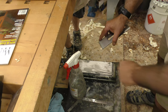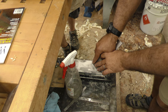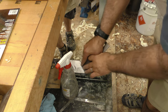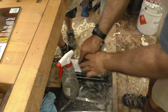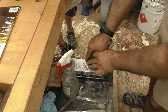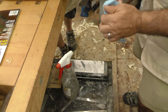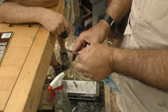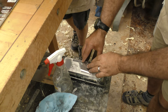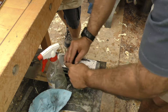Now we'll go to the 16,000 grit. Feel that bevel, come up a little more than on the 1,000 grit, move back and forth — it's a soft stone — even pressure for about 10 seconds. I'll finish with about three seconds of pressure on the right side and three on the left side. I should see a mirror finish — I'm seeing that shine all the way across. Now I'll put the blade back and take the burr off, same as putting the back bevel on.